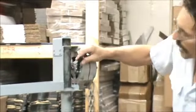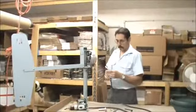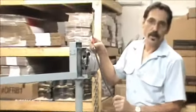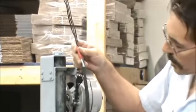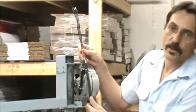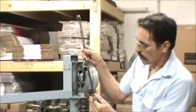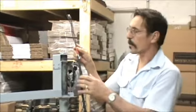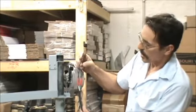Now you're going to have your 3-phase jack out here, and it comes with both ends. It comes with the male or female. And I've already made this cord up in advance. Took this wind turbine up. Just use a 10-2 with a ground, 12-2 with a ground extension cord, or you can buy good SJOOW cable. It's got a real flexible rubber casing, and it's meant to be outdoors in the weather. This will not crack or break. So anyway, I already made my connections just like this.